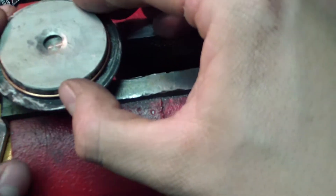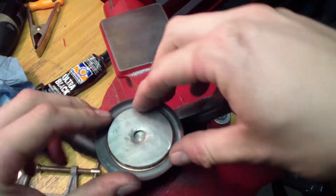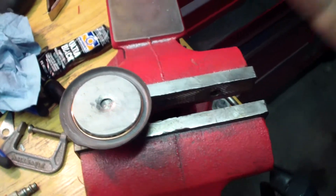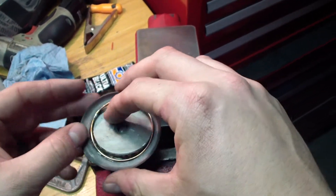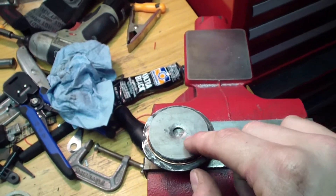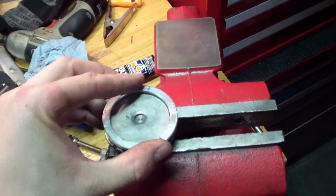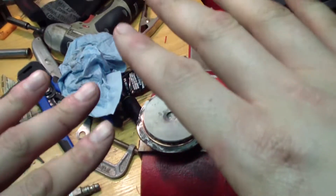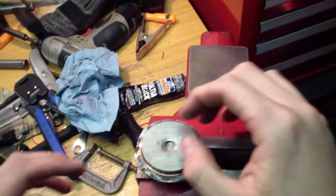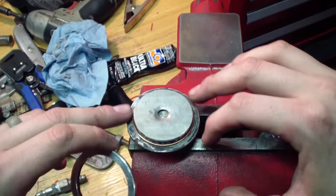Now put the ring on — it grips pretty well and will evenly space the seal. I'll glue it down, same as the guy who originally had this idea — he super-glued it, and I'm probably going to do the same or put a thin layer of epoxy down. Make sure it's all pushed down and flush. The good thing about 18-gauge wire is it's almost the same thickness as the seal, so it won't prevent the retaining ring from coming back down. Since copper is malleable, it'll actually compress and possibly seal better.